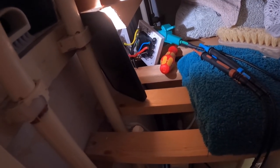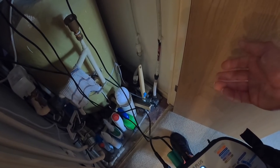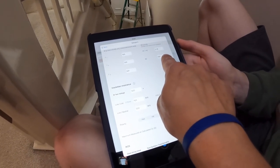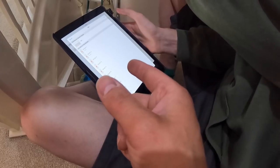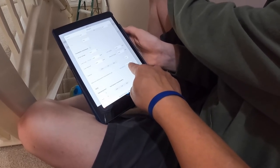That is this circuit complete. We can't do an RCD test because this is on the non-RCD side. It does technically feed a shower feeding the bathroom, but it's a pump — it's not located in the bathroom — so it's a bit of a grey area. You could put it down as a C2 if you wanted to, or a C3 recommendation. The client's going to want the board changed here anyway. We had 0.27 on our Zs at the fuse connection unit, our R1+R2 was 0.18. What was our incoming Zs at board? 0.10. So if you add 0.10 to our R1+R2 — 0.28 — we're 0.01 difference, which is perfect. It's all adding up — the electrical science is adding up.